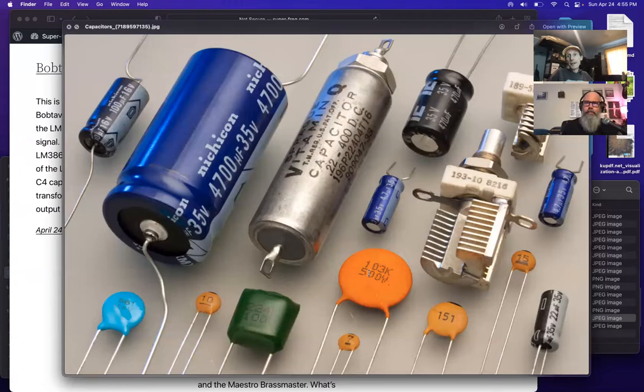To recap: 1 nanofarad equals 0.001 microfarads equals 1,000 picofarads. Having a cheat sheet with these conversions and what 'uF' stands for would be really handy. Rather than an app, writing it down in a notebook is the old-school approach - when you first start out you write it down and it sticks. The prefixes 'micro' and 'nano' aren't intuitive, which is why this trips people up.